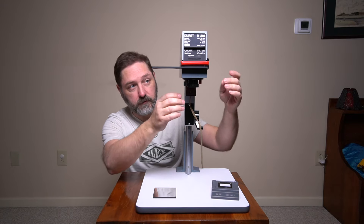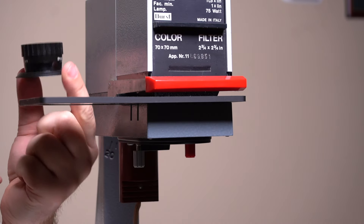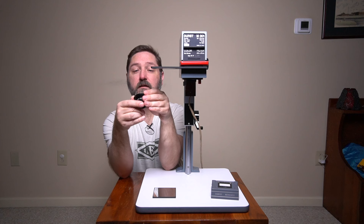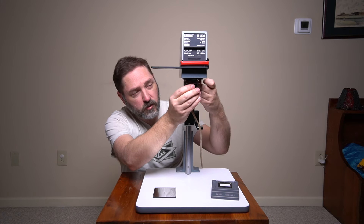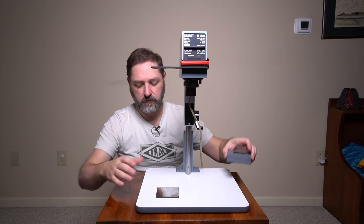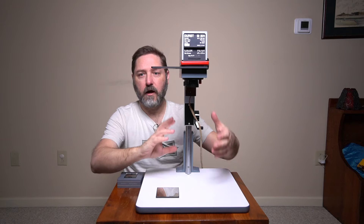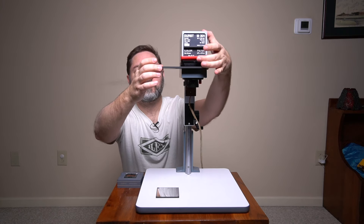To align the lens it's quite a bit different on this one. The lens is permanently affixed to the lens board. I noticed that the lens is not parallel or perpendicular to that lens board — it's permanently affixed, I can't change anything, I can't remove it. What I did find was that while turning the lens and lens board assembly, my infinite reflection moved and rotated to different positions. So that's what made me investigate that. If the entire assembly was off, I would expect it to be out of alignment, but as I turned the lens nothing would change. But because it's the lens itself, that's a problem.